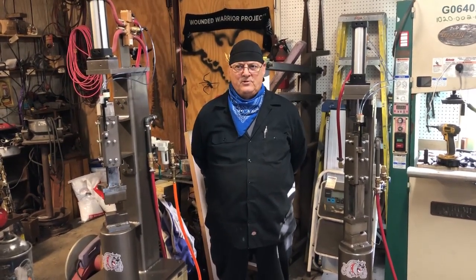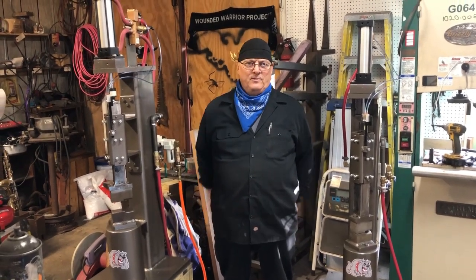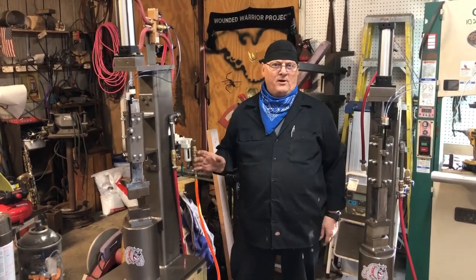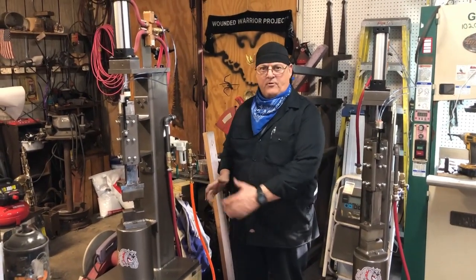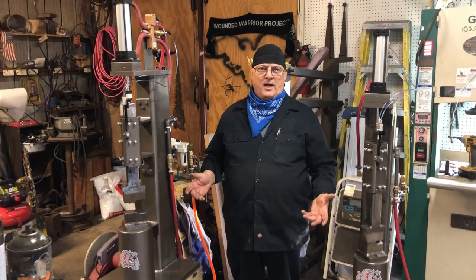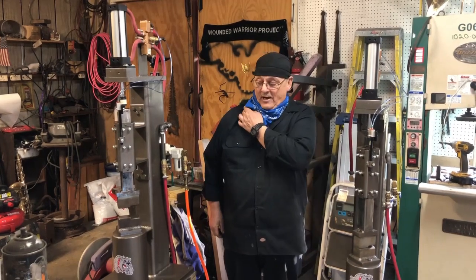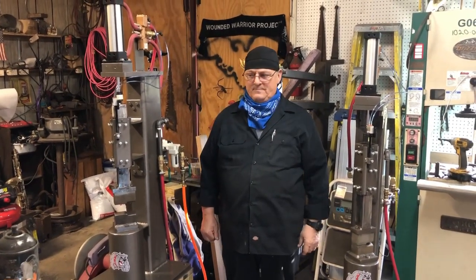These are going to be for sale here shortly. Today we're going to go over how to forge a leaf on a half-inch bar stock. These are small guys, so if you've got a small air compressor, it'll run it. If you've got a small footprint in your shop, this is alright. This won't do big commercial jobs if you're working on three-quarter inch stock — that would be very taxing — but it's a very handy little hammer and you can do quite a bit of work on it.